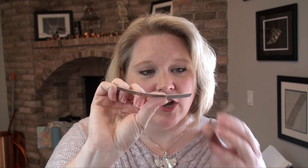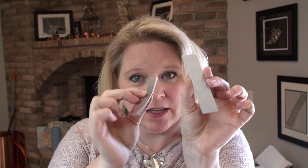If you know anything about different shears, you'll know that some of them end up leaving a curve. This started out as a solid piece — I used this in a bench shear and that's where we end up with the curve. Whereas with a guillotine shear, the way the blade is designed and comes down allows you to have a flat piece and keep that straight edge without it curling on you. That is where the power of these guillotine shears comes in.